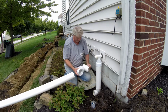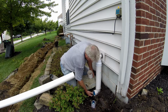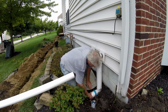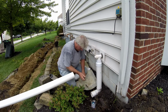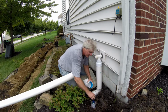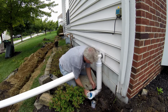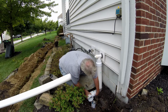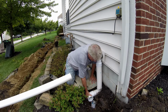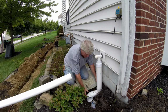Burr that pipe. Generous amount of OD on there. And if you've done nice prep work, this doesn't take forever by any means to put together. The most important thing is to have downhill flow. That's all in there good and tight.